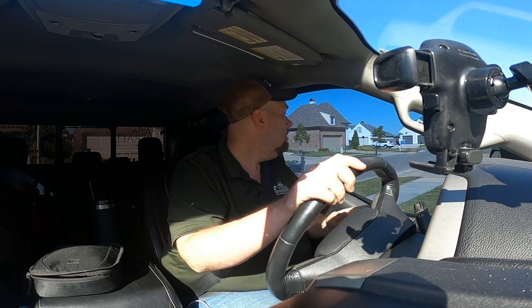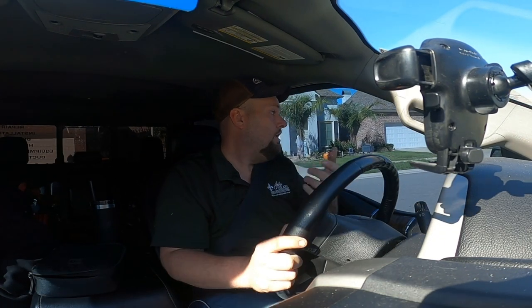All right, guys, in this video you're going to see me work on a Trane TEM air handler. That's a TEM, a TEM3 air handler. No heat call. Everything was working great till she turned the heat on. It's a common problem with these air handlers. It blew the fuse.